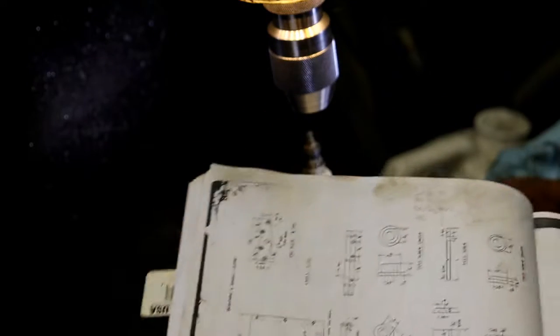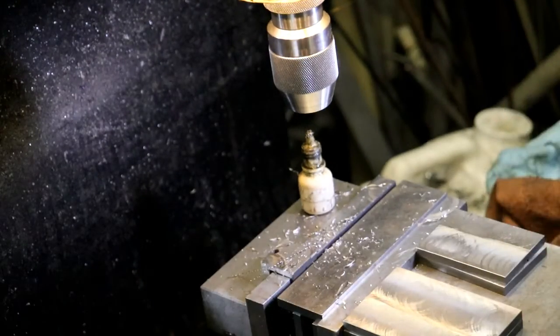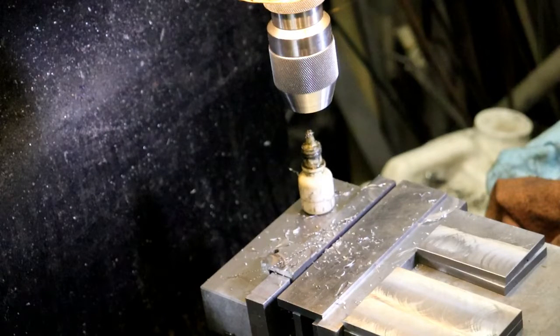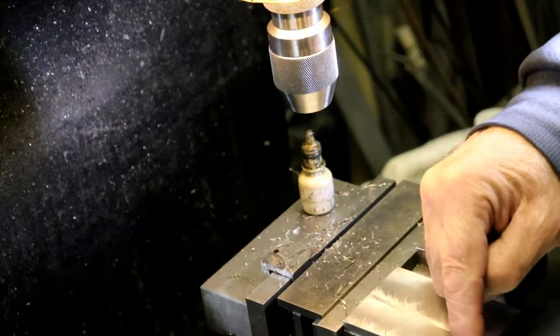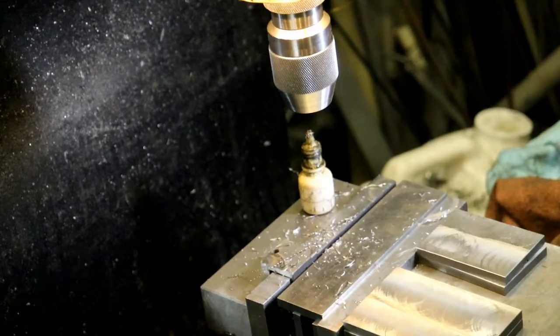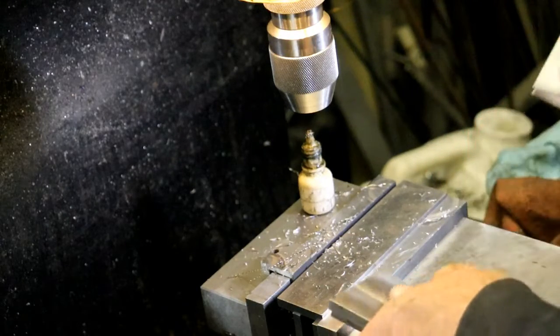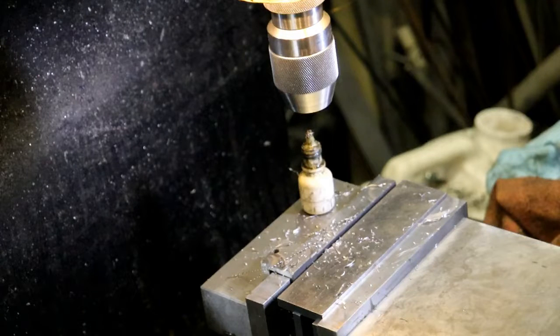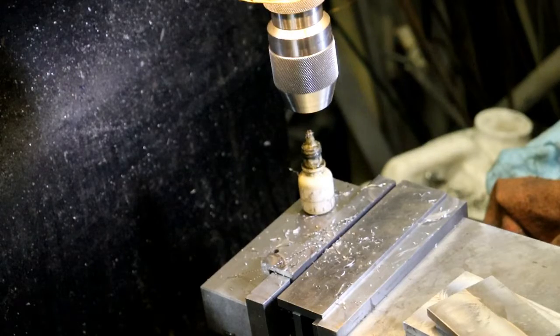I need 4 longer ones and then 4 shorter ones. So I'm going to go ahead and get some aluminum, and we'll come back, and I'll either hog them out off camera, and then we'll have to mount them on here with probably 4 screws on the long ones, and probably just 3 on the shorter ones, on the compound. So I'm going to go look for material, and I'll come back when I have some 1/4 inch material all milled up and ready to go.